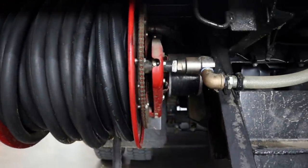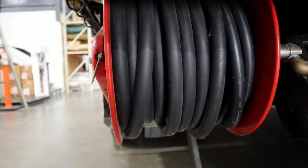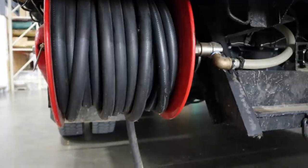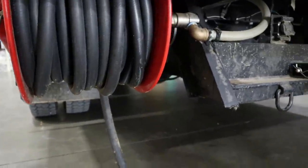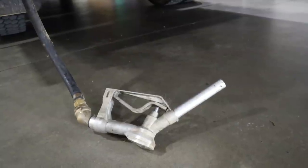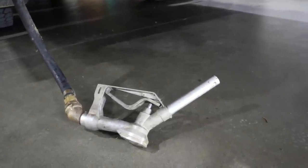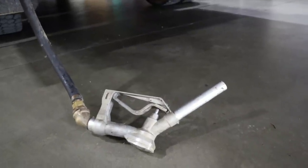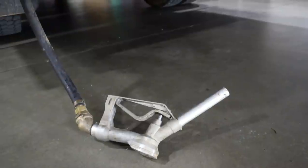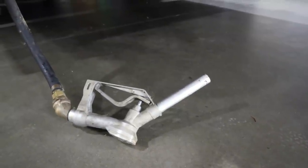This reel has an electric motor on it — a 12 volt motor. It's a hundred foot of rubber hose; I like rubber hoses and do not like vinyl hoses. I'll put a link to this reel and where I bought it in the video description. It's a really nice reel — not real cheap, but worth the money if you're going to be doing this all day. It uses a standard fuel nozzle you might buy at Tractor Supply or Northern Tool. It's one inch throughout, and we reduced the hose fittings up to one inch to go into the nozzle — you can get these nozzles in half inch and three quarter, but you're better off with the one inch to keep your flow good.